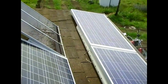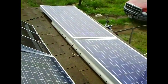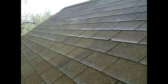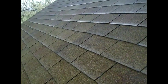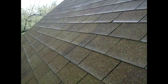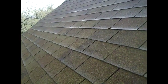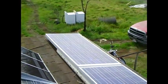When installing your panels, you can get professional mount systems. If you're installing them on your house roof, be very careful and aware of what you have underneath — you might have pipes or wiring under the shingles. Don't just go screwing mounting systems in willy-nilly because you might drill through something and get a shock or cause a leak. Go up in your attic and check around where you're going to be mounting. Also be very careful working on a roof so you don't fall off.